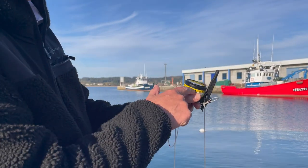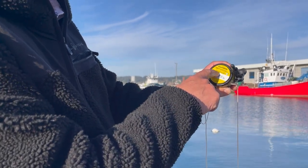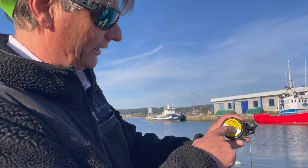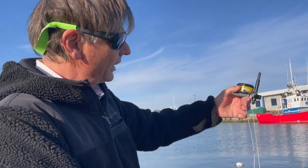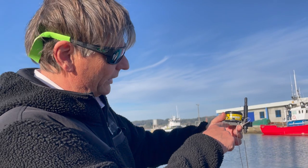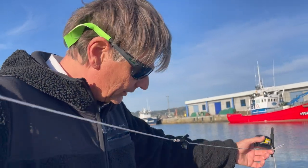Now the old H20 — that's what we're going to test to see if it still works. Follow me testing the H20 in the water — my old, expired one from the EPIRB. It says release depth is one and a half to four meters. So when the EPIRB goes down one and a half to four meters, this should release the knife, cutting the bolt and releasing the EPIRB. Let's see.